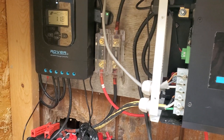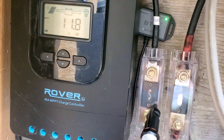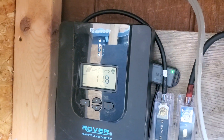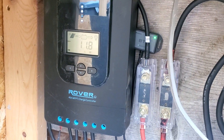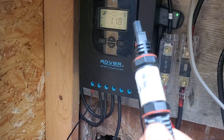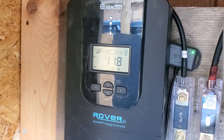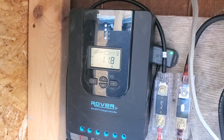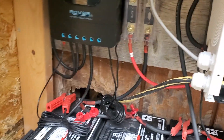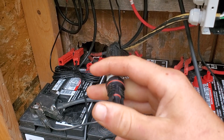Now, what I didn't realize — I don't know how long it's been going, at most only a day — but basically my fuse here has a little hairline split in it. As you can see, the battery indicator is blinking with no bars, which means it thinks the batteries are dead, giving me a low voltage warning even though it's still reading 11.8V. The panels aren't sending any power because that fuse is blown, so I'm not getting a positive current to my batteries.